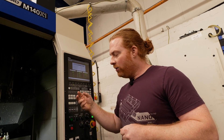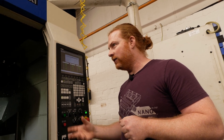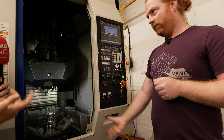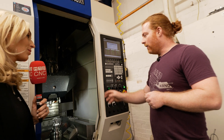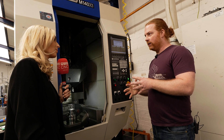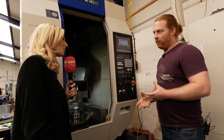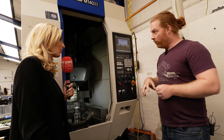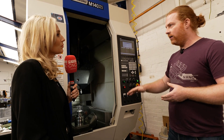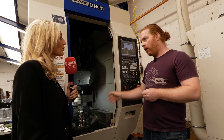It all adds up to a bill of materials which is very expensive. You'd have thought a complex long-cycle-time monoblock part is an expensive way of doing it, but it was a massive cost reduction for the customer. All the tolerances are held in one place, there's no assembly, fewer parts to anodize — so it costs a fraction to anodize — and all the tolerances are better. From my point of view I could reduce cost further because it's got a long cycle time with a lot of walk-away time, so you load the parts, press go, and leave it.